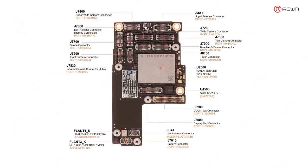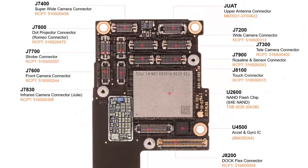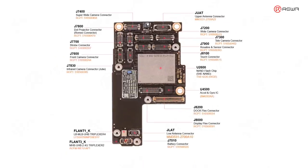Here there are some chips that look like they're made of glass. This chip is mainly related with the power supply for the rear camera circuit, and this one is for the front camera circuit power supply. These chips have a shading cover, so you should remove the shading cover first if you want to see them. The last one here is a crystal — code number Y1000, a 24 MHz crystal which works with the CPU.